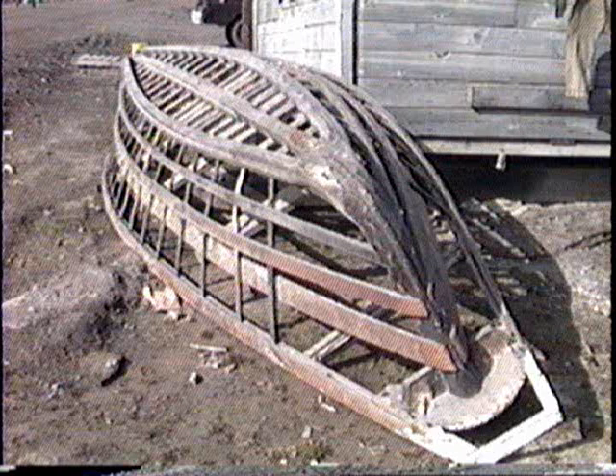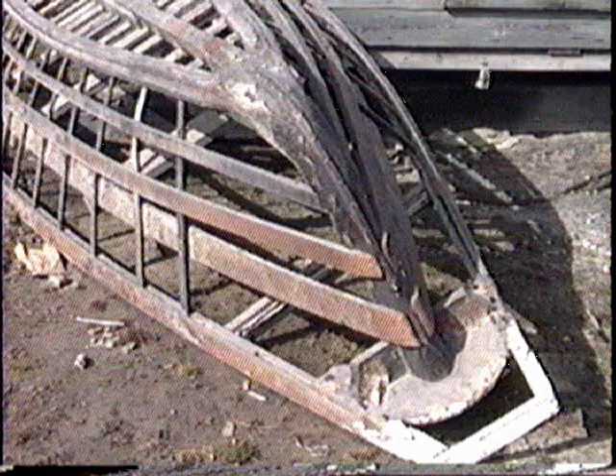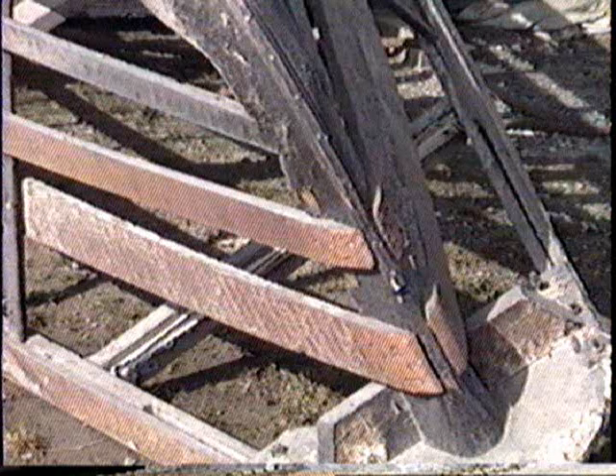What's very interesting about the design of this boat is that the frame is planned so that the skin has plenty of area for air circulation, so that the skin will dry very quickly. This is a close-up of the bow showing the stem with the stringers, the gunwales and the inner stringer, how it attaches to the stem, and how the ribs are distributed. You can see in even more detail how air is allowed to channel around the skin that will be covering this.